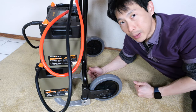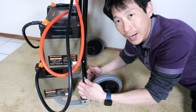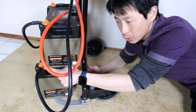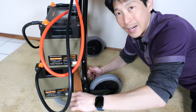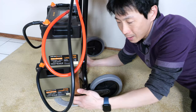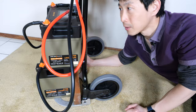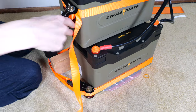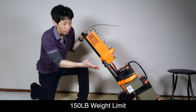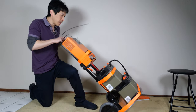I want to secure these batteries really well on here. If I tie both batteries individually and attach this towards the hand truck, it's going to pull the battery in and put pressure on these terminals. So I found a 2x4 that's 19 inches long to go along the back — now we can pull it in. It can rest on this 2x4 and it won't put pressure on the lugs. I ended up putting the clamp right there. I got a cheaper cart that's not too heavy duty, and it can support the weight of the batteries and the inverter.